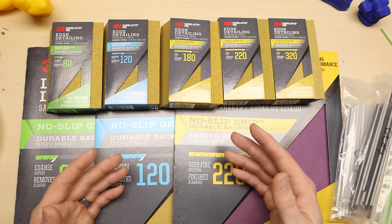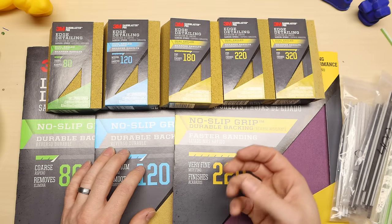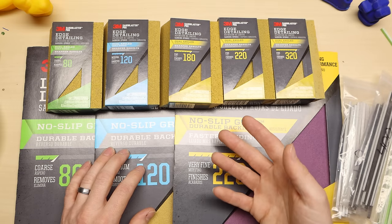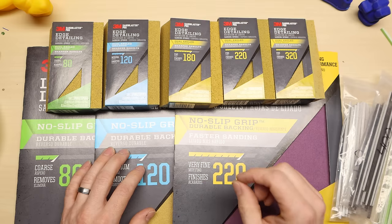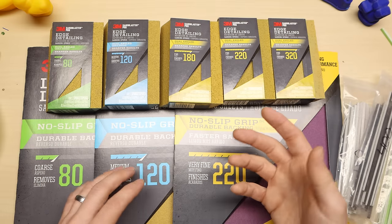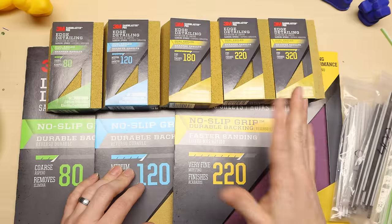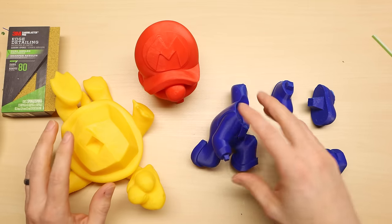Sometimes with an orbital sander or a palm sander, it will heat up the PLA too much and it'll start to become gooey and deform your 3D print. So just be aware of that if you're going to be sanding with anything electric, like a palm sander. So I have all of my printed pieces, and I also went ahead and removed all of the supports